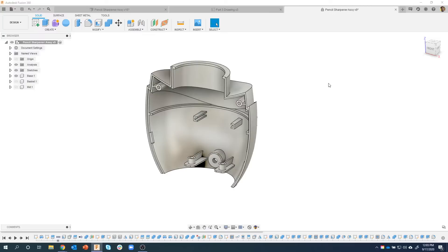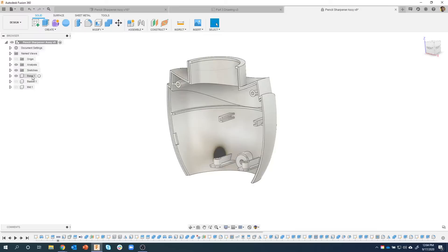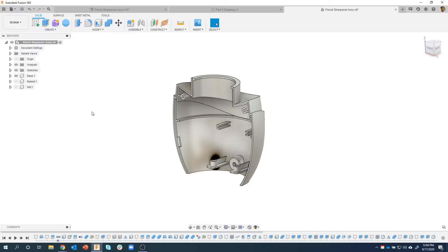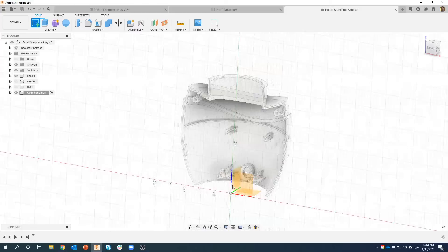Let's jump in from where we left off last time. We finished creating the other half of the base, and now I want to use information from that base to help me design the next part. The first thing I'm going to do is create a new component. We've done the base component, which has two bodies — both sides — and we also have the basket and the middle ring, which we'll come back to later. I'm going to right-click and say new component, and call this guy 'gear housing.' I'll have it be active, so when I say OK, the other ones are turned off and gear housing is the active component.